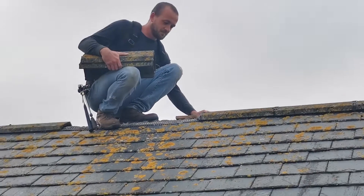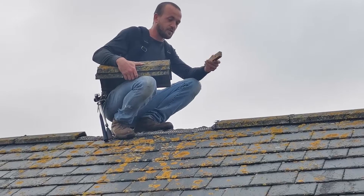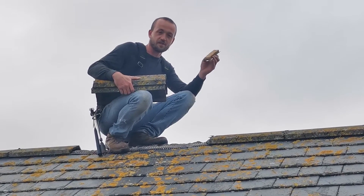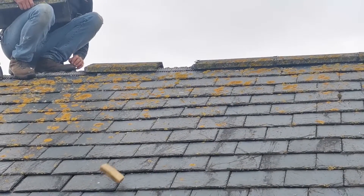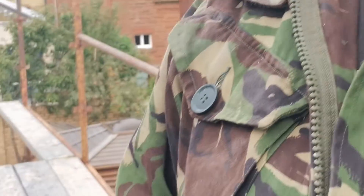We're doing something very interesting today. The nails weren't long enough to hit the ridge beam, so they've put sarking in to fix the ridge too — but the sarking isn't fixed either. There's another bit there to see if it's fixed — that's just a tiny little bit stuck in, that's not fixed. But then they've nailed the ridge to the sarking. So where is it?